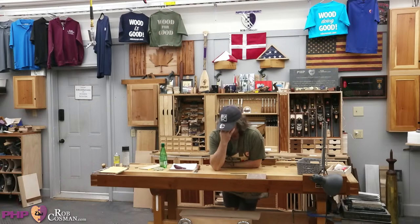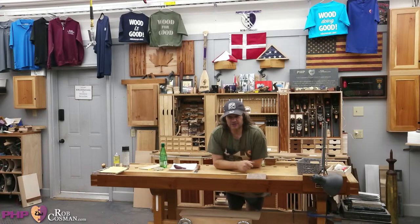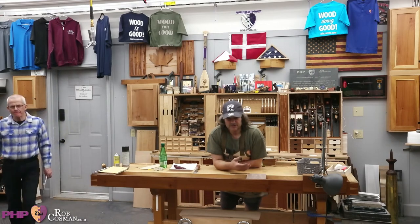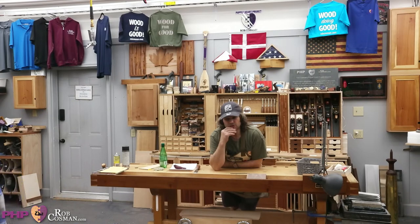How long should it take? That also depends on how far you want to take your chisel, meaning do you want to take them up to 16,000, 30,000, 8,000, 6,000? If you want to do it the most efficient way, I always tell people to start with 1,000. Jake likes to start with 500. With 500 or 1,000, you shouldn't have to go any lower. If you do, you've got bad chisels. They should come to you flat. Your job should only really be to remove the grinding scratches. As you get rid of the grinding scratches, it's going to allow you to get a sharper edge. Think about that microscopically.